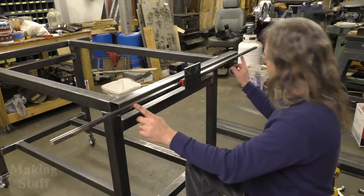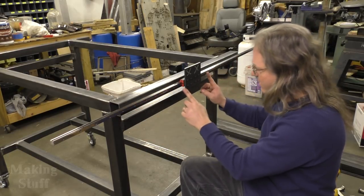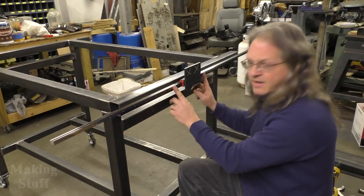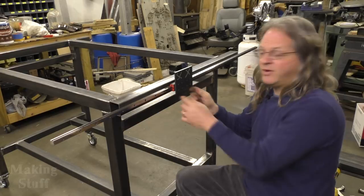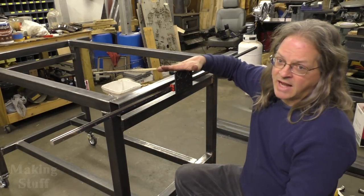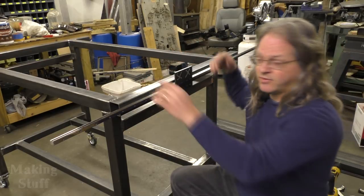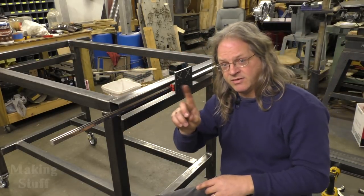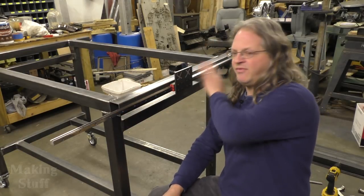Okay, so I've got a screw on each end. I've drilled and tapped a screw and put it in there, and also here in the center on each side of this plate, and I've run the bearing block down through here with the dial indicator and the magnetic base, and it's 5/1000ths from end to end. The needle wants to fluctuate a little bit. It goes back and forth, but it's no more than 5/1000ths.